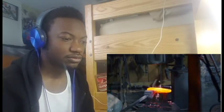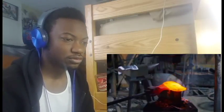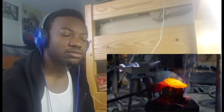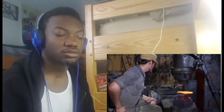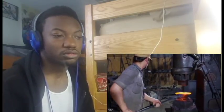You may notice that we have a little extra material on the edge of our axe now. Ilya basically did what would be called a reverse hot dog in the bun method, where he took a billet of Damascus that he layered with some more wrought iron and folded over the edge to give us some more mass.